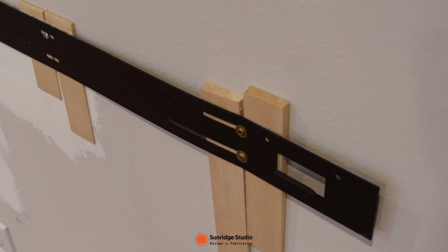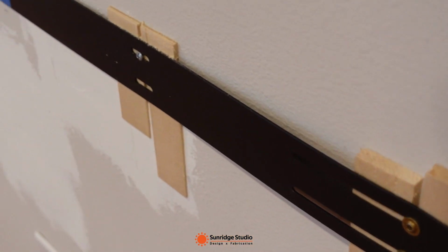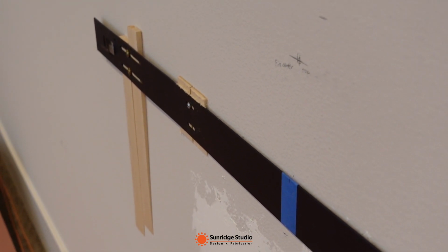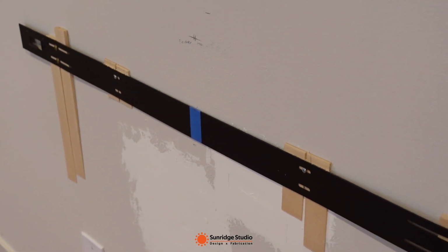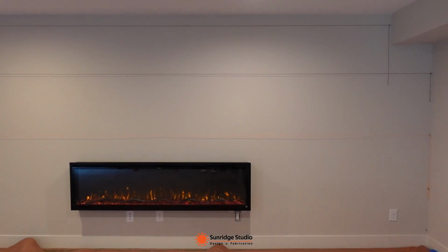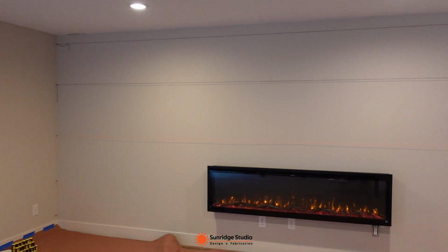The wall-mounted installation is quite straightforward. I just screwed a metal bracket to the wall and then hung the fireplace onto this bracket. I used 4 screws to mount the bracket to studs and another 2 screws to drywall anchors. The existing wall of my basement is very uneven, so I have to use quite a lot of shims.